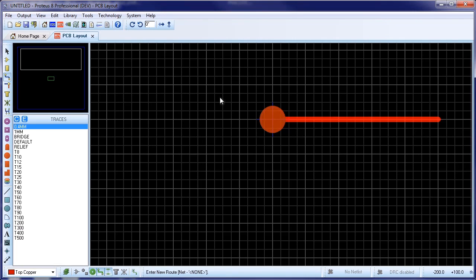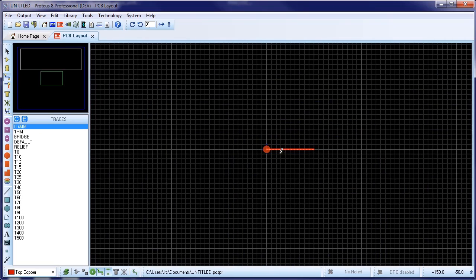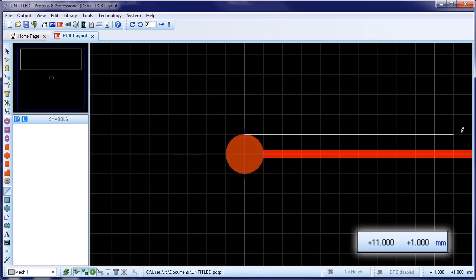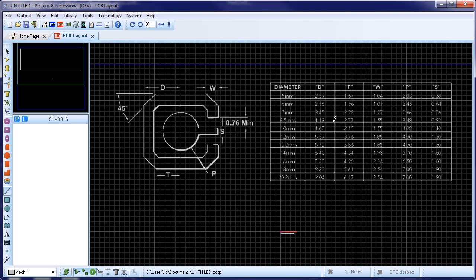Next, we have to set the minimum escape clearance from the track. If we make this clearance 0.8mm and add on half the width of the placed track, that gives us a vertical clearance of 1mm from our origin point. This can be shown by placing a couple of guidelines, making sure to switch the coordinate systems to metric in order to measure the distances. If it's tricky to place the line in the correct place, it probably means that the snap grid needs changing. In metric mode, the third snap level, F3 on the keyboard, is a 1mm grid that suits us perfectly. The coordinate display at the bottom right can be used to confirm placement, but with the correct snap setting, it's simply one grid square from center.